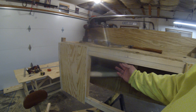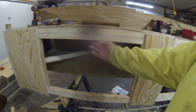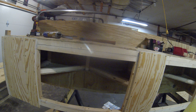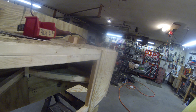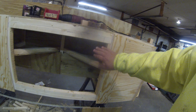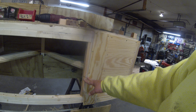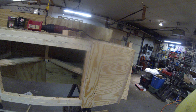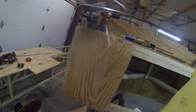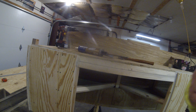There's a screw there — interesting that one went through, I'll have to grind that down. Hindsight being what it is, if I would have done the bracing first, I could have cut these as one panel, would have looked a little nicer. This one's at least got the grain going the same way, but there is a seam there.